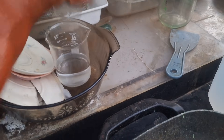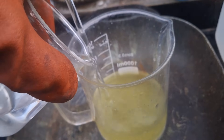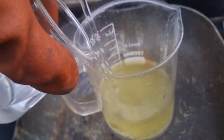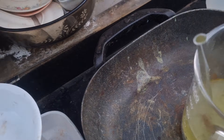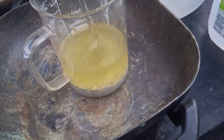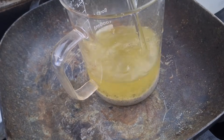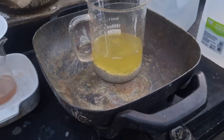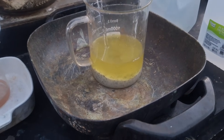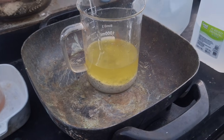Adding some nitric acid — a pretty good shot, about 10 to 15 mL. The reason to go a little extra on everything is that this isn't like a karat gold ring. It's got a lot of junk in it and it's got to be beaten pretty hard to make sure you get that gold. With a clean piece of gold you just drip in a little nitric and when the gold dissolves you're done, but this is a whole different ballgame — a lot of material, kind of like doing electronics refining. You've got to really nail it. Adding a little sulfuric acid too — make sure there's no lead — and getting it cooking hot.